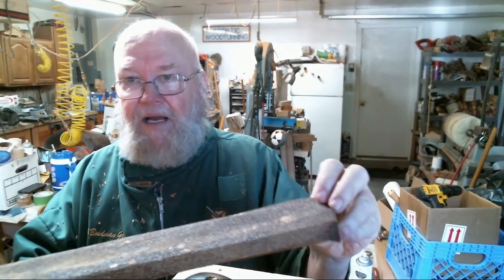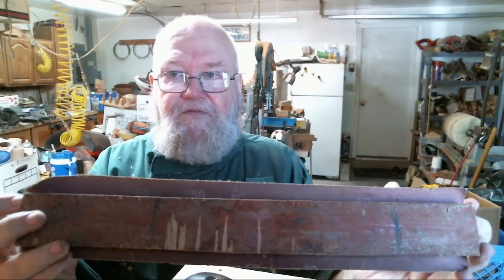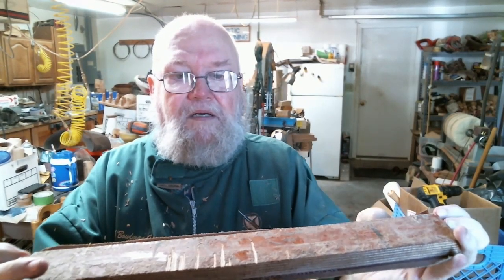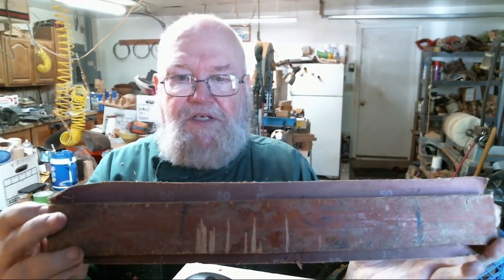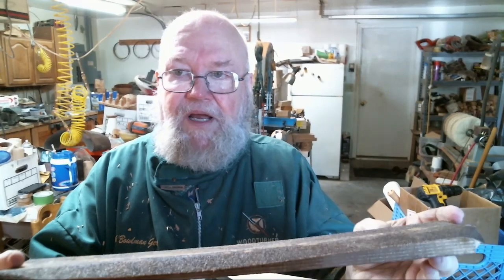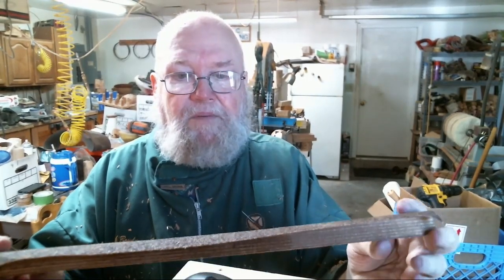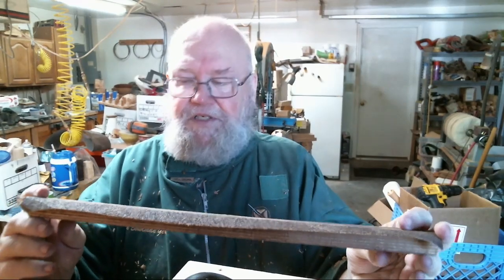I have my next tool. This is my rolling pin flattening tool. It's a piece of Formica backed or melamine backed plywood. You can get it at different places. I just cut a length and I used 3M spray adhesive and I glued a piece of 80 grit sandpaper to it off of an 80 grit sanding belt.